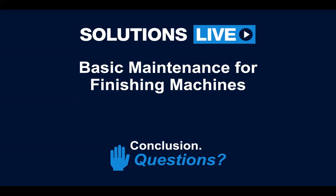Once you start this, it's going to affect your spray pattern as well. So any damage that's done to those air horns can affect the spray pattern, again, whether it's through dropping, or the pitting that you might see if you leave your tips and caps in that solution overnight. Things that you want to avoid are damage to those air horns. So just wanted to point that out as well, that any deformation there can create issues.